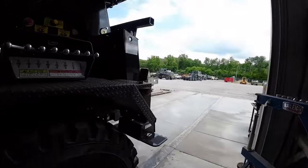All right, so Mr. Kevin's got some new hydraulic valves up here. The reason we had to add those, these two valves run these two big winches up here, and we need to power beyond to run that wrecker boom. So we got some new valves, run power beyond there, but you got some super sweet air cylinders. What's that do? Remote control, huh? That's right. So we got a little transmitter there. These are all gonna be remote control, so you can run everything from the ground wherever. The wrecker boom's actually remote control too, so nobody has to come up here and run these, but you still can if you need to.